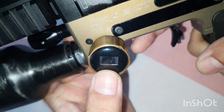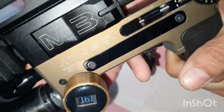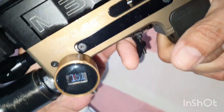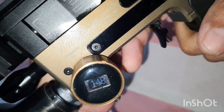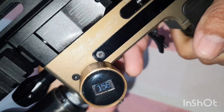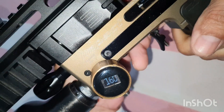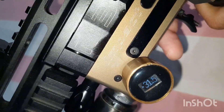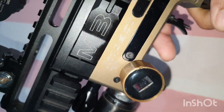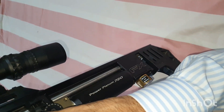Now it will show - this is the 161 bar pressure. I fire once again, it goes down to 150, right, 148, and again it comes back. Even on the digital gauge it comes back to 160. So this was 161 and it quickly came back to 160, and it will soon get back to 161. So this reg is working perfectly.